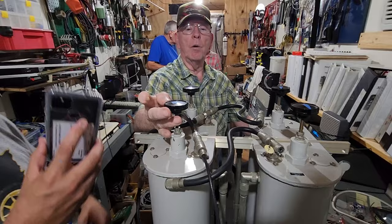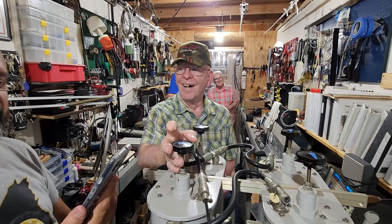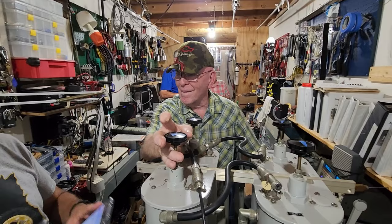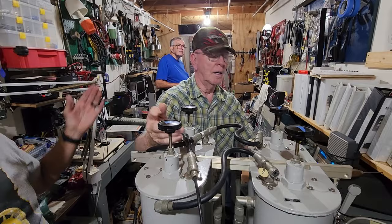We're done. At 50 ohms, 0.112 microvolts is negative 126.005 dBm. What Don has shown with the service monitor is that he's got it down to just a tiny fraction of a microvolt to come through the cans with that tone. That means they're essentially very sensitively tuned even by just using the audio.